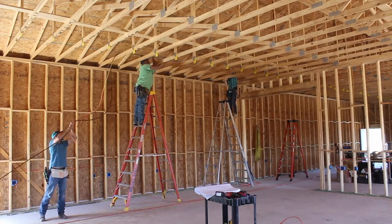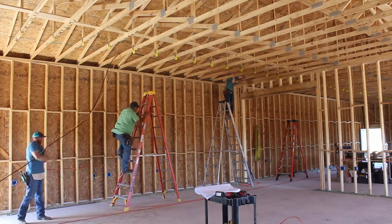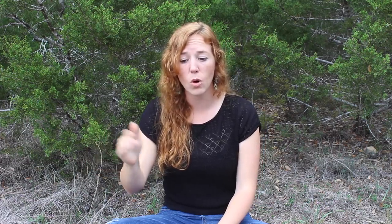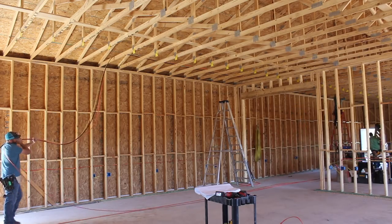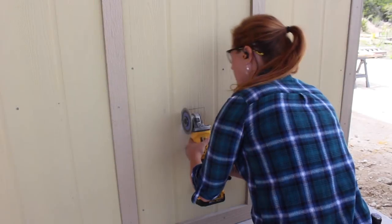The panel itself was placed over in the woodworking shop, so most of the runs in the woodworking space are run through the studs, which is a little more time consuming. However whenever we moved over to the metal shop side, most of those runs go vertical on the stud base then are run through the ceiling over to the panel. Instead of taking a diagonal shot to the panel, we kept the wires running parallel to the walls — this ensures plenty of wire if things ever need to be moved around, and it keeps the center of the attic space clear.